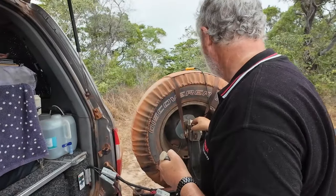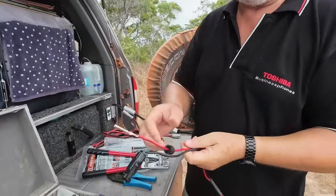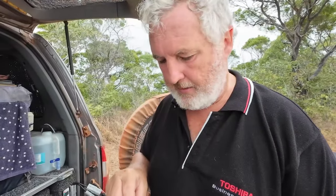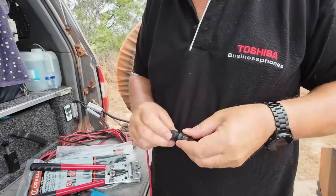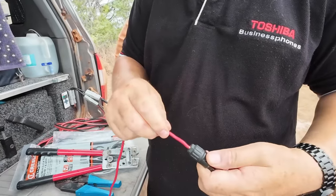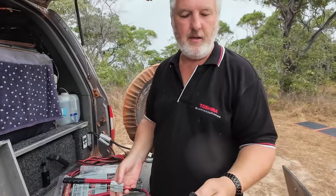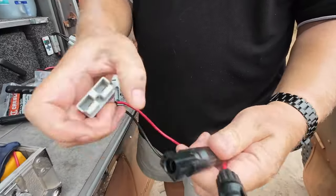I crimped it but it just needed a bit of extra soldering. Turn that off the inverter without burning myself, or melting my toothbrush. Stick that up there to cool. And now that is connected. Still warm. That's now solid, it's not going to come off, which means I can push that back into that connector, all the way home. That's it, it's running. And then screw that back on. And there we go. So it just pulled out basically - it wasn't crimped 100%. This is one I bought on eBay a long time ago and it's just an MC4 connector. These are MC4s which you get with your solar panels, into an Anderson.